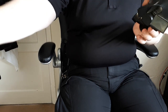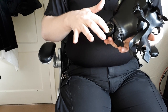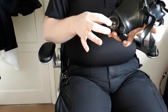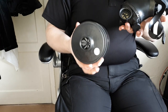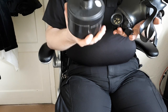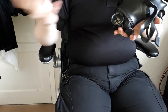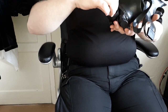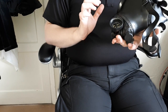Also, something you should note: on the filter intake port on the mask itself, the rubber gasket inside was loose — it actually came out and was flopping around. There is a valve in there which, when you breathe out, prevents air from getting back into the filter. When you exhale, there's a lot of water vapor, and that will clog up a filter much quicker if it's not blocked. So if you get one of these, press around the outside on the rubber, or if it is loose like mine was, pull it out carefully, wash it, and then press it back in fully so it will be seated properly.